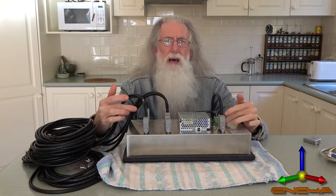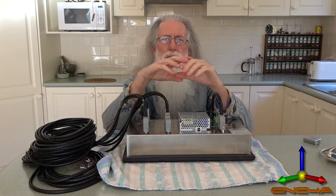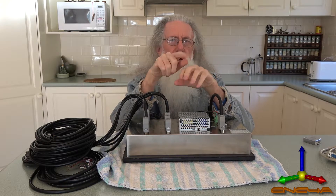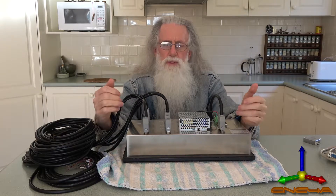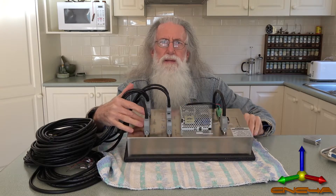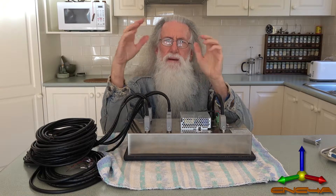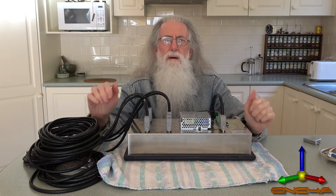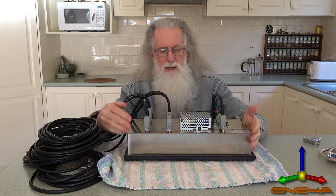The next problem is you might find a cable — I looked through all the monitor cables and found a DB9 or DB15 — but when you look at the back of the plug, instead of having all the pins, a couple might be missing. I cut a couple of cables open and there aren't as many wires in there as you'd think. Every pin hole needs something connected. So if it's a 25-pin, there are 25 wires. It's no use getting an 18 or 12-wire cable. You have to find a cable source with the full number of wires.